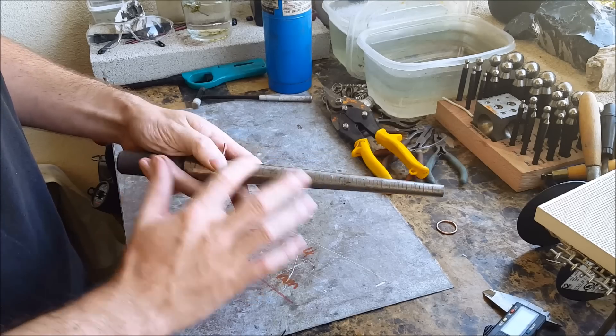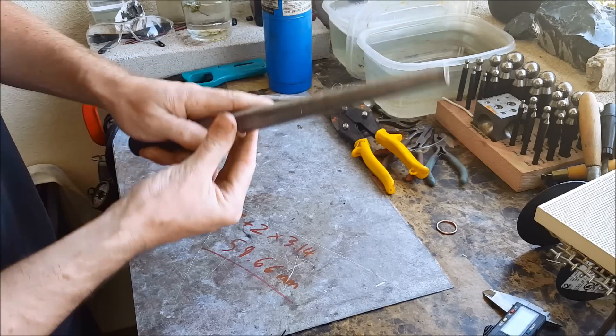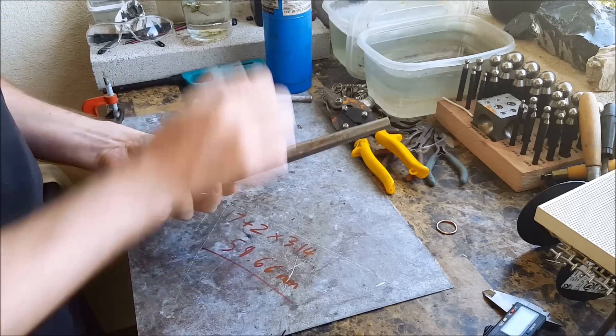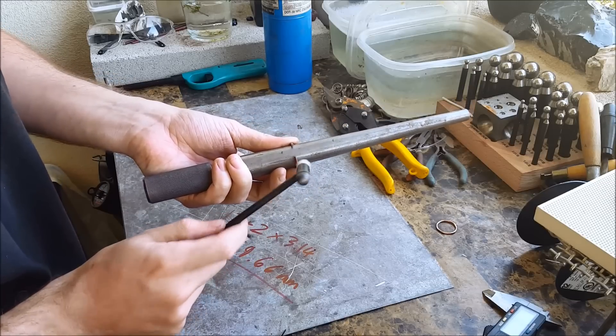This is where you want it to be, but you need to come back here where it's bigger — it's easier to bend around. From annealing it, it made it so easy to bend you could do it mostly with your fingers. Get the two top edges down without stabbing yourself, then take a soft hammer and hammer them down until it becomes flush.